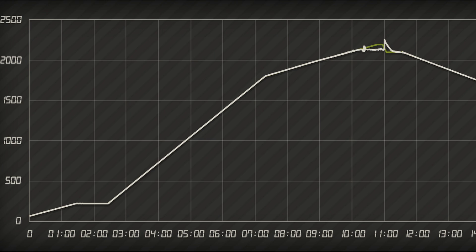Recently during a firing, I was getting something a little bit weird. Here is a graph of the program — you can see the white line, which is what actually happened, versus the green line, which is what was supposed to happen. At the top of the temperature range it got very jaggy, then jumped up all of a sudden and came back down. I believe the thermocouple wasn't reading the temperature properly and it actually got a little bit too hot. I remembered to put cones in this time and indeed it fired hotter than intended. I meant to hit cone 6, and it probably hit cone 6.5 or maybe 6.75 — just shy of cone 7.